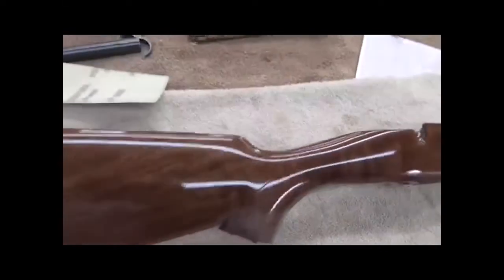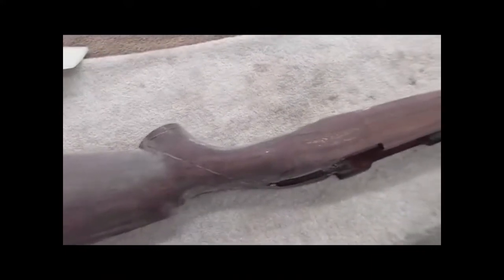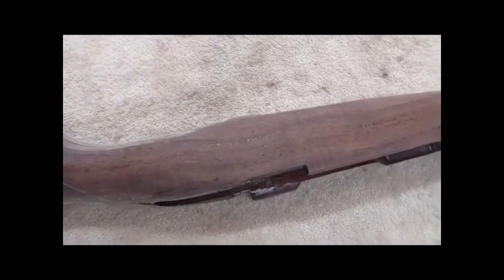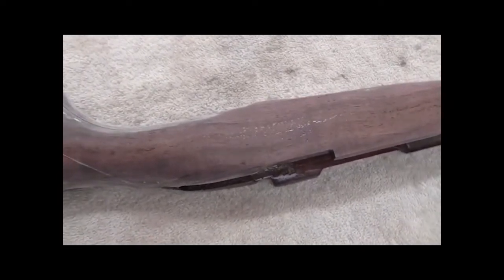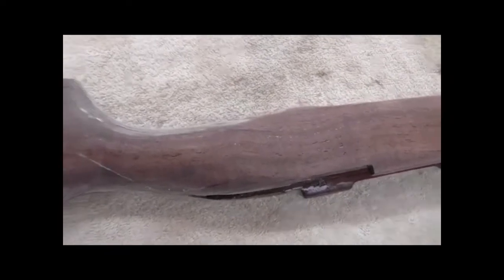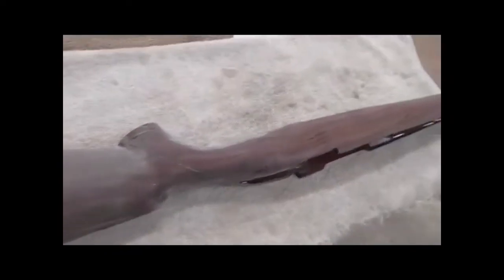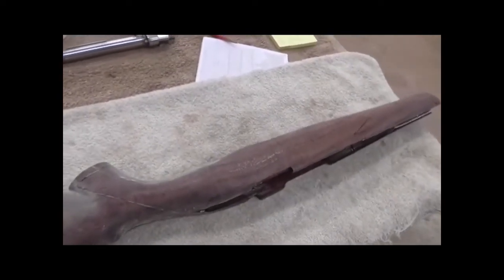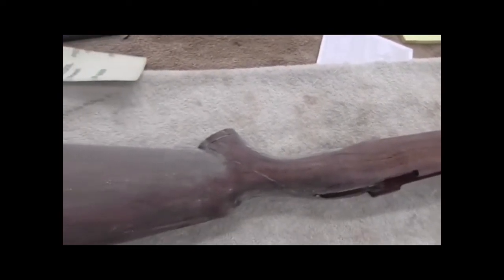You can see them if you roll that light — the shadow of the reflection — across them. What I've found out with this Permaline is if you sand it and spray one light coat, light coats are very important. Most all coatings I've ever heard of — in fact, all coatings I've ever heard of — recommend multiple light coats as opposed to very few heavy coats.